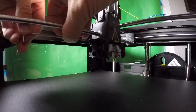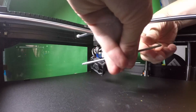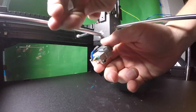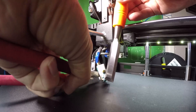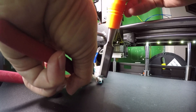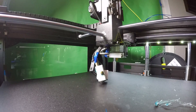Knowing that, it was time for me to fix it. I thought, well, I could clear this — let's take it apart. Here I am taking the fan off. The fan came off pretty easily, I just had to unscrew it. Now I have the throat, the heater block, and the nozzle. You have to undo these little grub screws, and the problem was there was plastic holding it on, so I preheated it and then was able to scrape off all of the offending plastic.